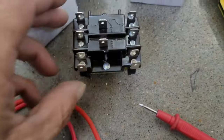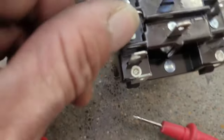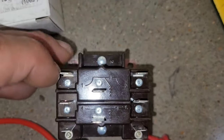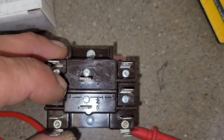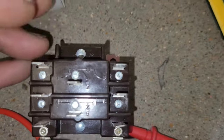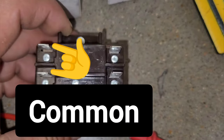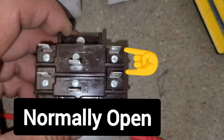The switch I'm going to use to replace it is this one — it is a 24-volt coil. This is my diagram on it. This relay most closely resembled what I needed to replace. When we energize the coil with the required voltage, it's going to send two sets of circuits — different places. We can have one normally closed and one normally open circuit, so they can do different things. And just like that, that's how I got it wired, and that's going to do what the old one did.